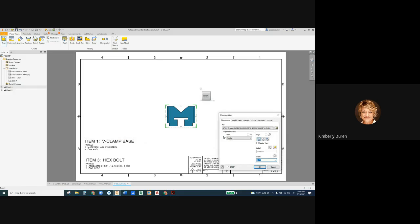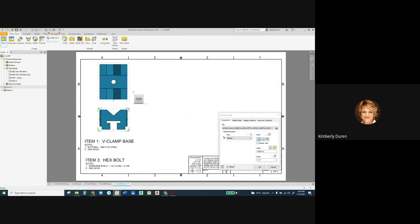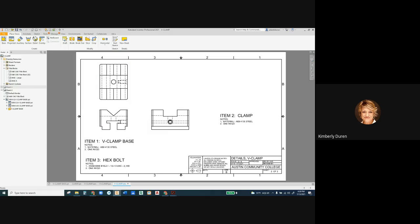It's in the same format as the rest of them, and that looks pretty good. I have to have three views: this one for the profile, the top view which is pretty deep for the hole in the top — any view that has a hole needs to be shown — and the right side view. Make sure these are oriented correctly. This is show hidden lines, three-quarter scale, and we don't need a label — it's going to pop right into my template.